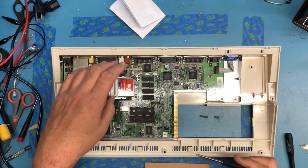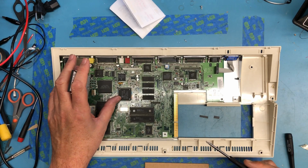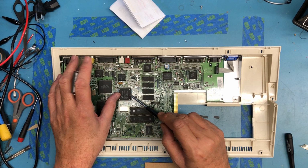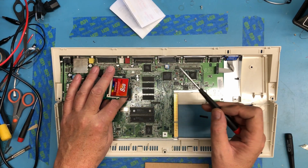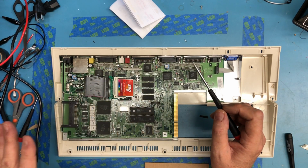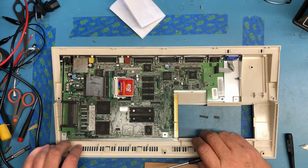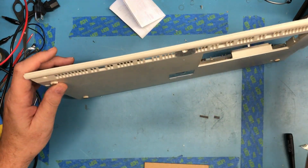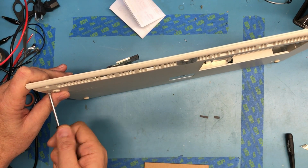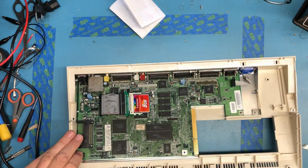Now, if I remember correctly, in the Individual Computers notes, that video device snaps down over here, and there's a lot of flex underneath the board through the plastic. So I really think I want to pull the board out so at least the RF shielding is sitting down flush, and it hasn't got the rubber feet underneath with the flex in the board, etc. So let's go ahead and isolate the PCB from the bottom of the case.